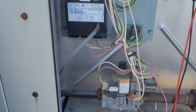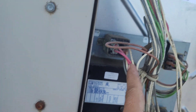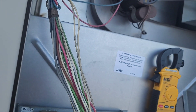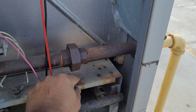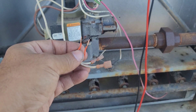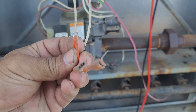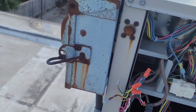For this demonstration, I have taken out the venter motor relay so the motor will not turn on, because it is very loud. I'm going to insert a jumper between the two pressure switch wires, but before that I'll turn on the power and check if we're really getting 24 volts on one of these leads.